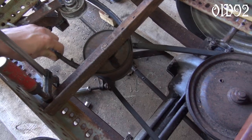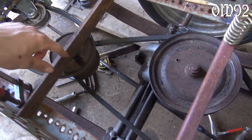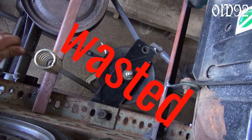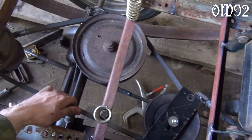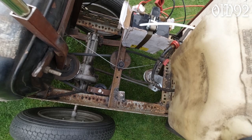The pull side of the belt needs to be straight — it won't work if there's a bend in the pulley, because the straight-line force from the engine doesn't want to go around corners. After I was finished with the reconstruction of the belt clutch drive system, I was finally able to test the whole thing on the streets.